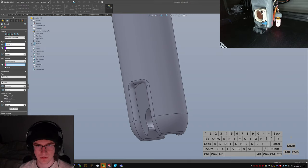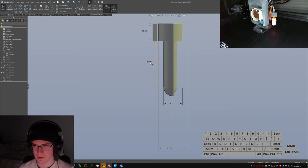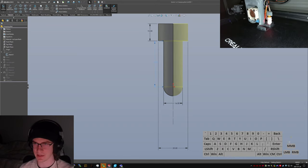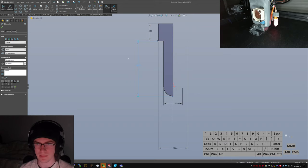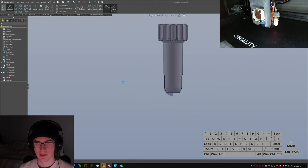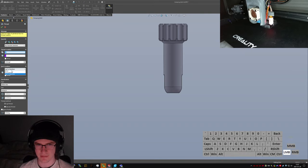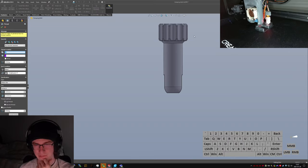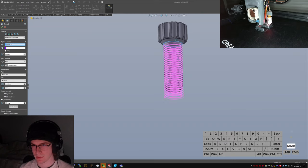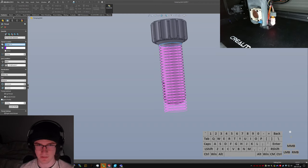Well, we'll do... Hang on. If we come back to this revolve sketch here, say, what is this? D2 at sketch 1? Well, I'm going to delete it, so it won't be, but whatever this dimension is, 48 millimeters, that's D2 at sketch 1. If we do our thread feature and tell it to be length of D2 at sketch 1, then it'll always go the full length of the part. We don't really have to worry about that. Okay, that looks good. Metric die, M16-2. Trim with start face, trim with end face. There's not an end face, so that's fine.